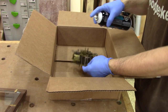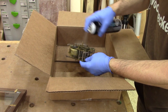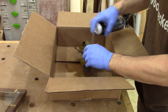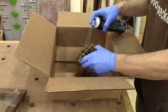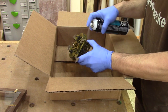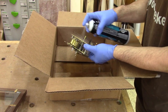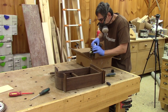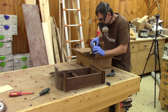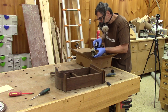This doesn't surprise me because this clock is almost 50 years old and I think it was never cleaned before. The way professionals clean this is to dismantle the clock and put everything in an ammonia solution. But I've seen one guy who cleaned his clock with brake cleaner — I said to myself, this would be much easier. So I sprayed a good quantity of brake cleaner everywhere I could see a pivot. This really did a great job — all the gunky oil that I saw before vanished.